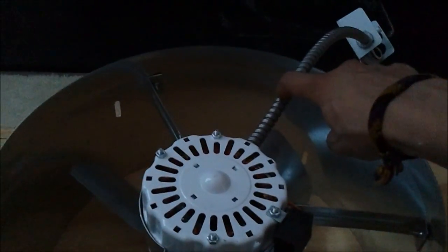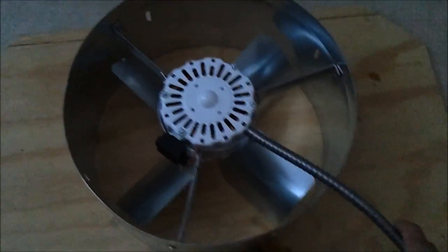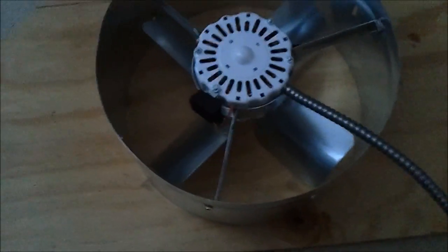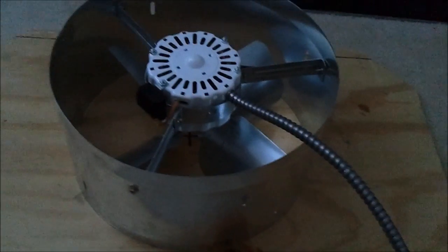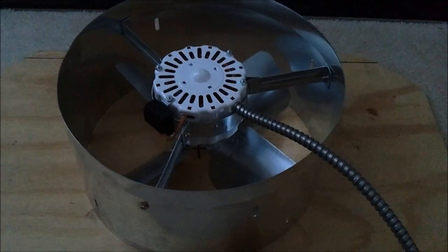Also another thing to think about, your wiring box, you want it pointing down. We're going to rotate this all the way around. Remember, this is going to be on your roof. Again, you want this pointing down, depending on my wiring going down. But if your box is up, then hey, that's what you got to do. And now we're ready to go on and trace the outline so we can get to drilling and then cutting our circle for a housing to fit down into.